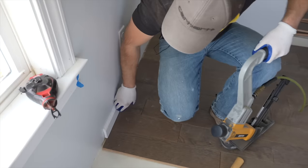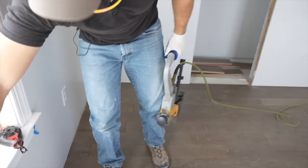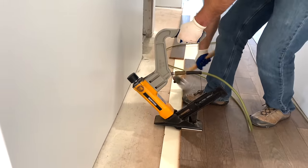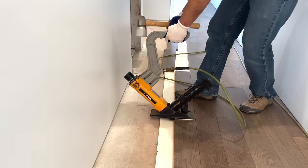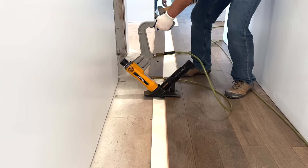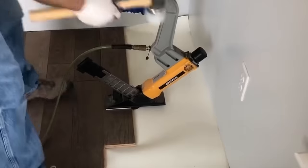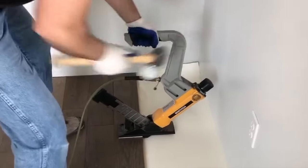I always like to keep a scrap piece of baseboard on hand to check that a row isn't too short — this one was just an eighth inch from being too short but it was fine. An awesome feature of using a pneumatic flooring nailer: when there's not much room to swing the hammer right in front of the nailer, you can hit the circular part straight at it while holding firmly with your hand to drive nails, as demonstrated here. Once you get tight to a wall, don't hesitate to try this — but be warned, you run the risk of hitting your drywall and having to repair it later, so only do this if you feel comfortable.